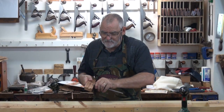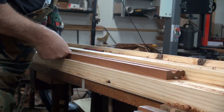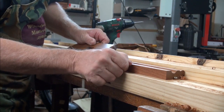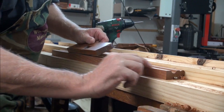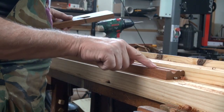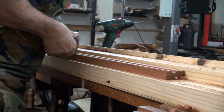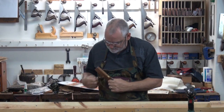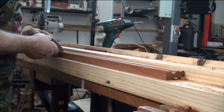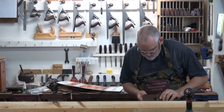I've got the marking gauge set. Draw that line in. Rebate plane — again, we'll have it leaning this way so we're cutting this part off and we've got a fillet here. I quite like these beveled angles so I'm going to keep going with that — bevel this before I roll this over. Putting a little bit of a bevel right on the end, and then we'll do the same with the hollow as we did before.